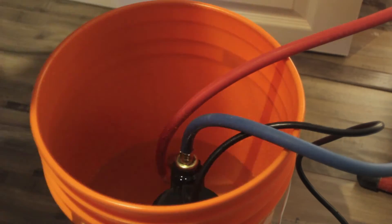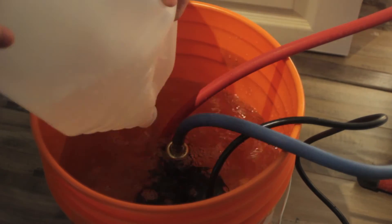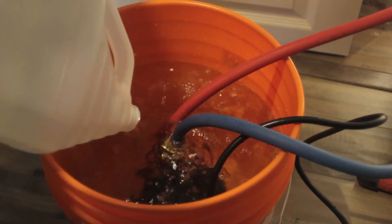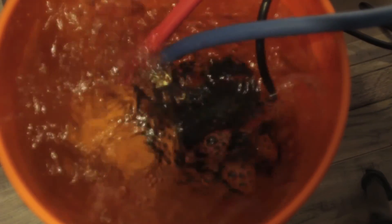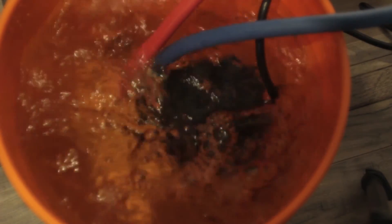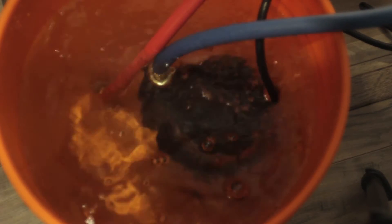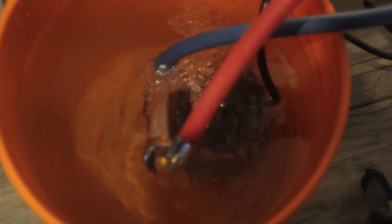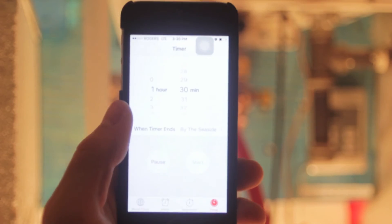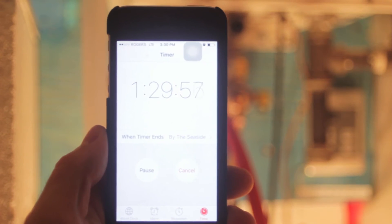Place the pump in the bucket and connect the hose from the cold water service valve to the pump outlet. Pour four gallons of food grade white vinegar into the bucket. Operate the pump and allow the vinegar to circulate through the water heater for at least an hour. I prefer to do the flush for an hour and a half.